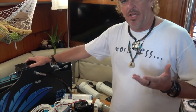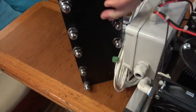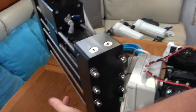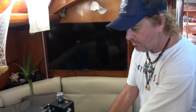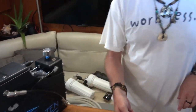The system has two major components. The first is the reverse osmosis or desalination plant — this is where the membranes are. It's all cased in, but behind the casing are the pressure vessels bolted together with manifolds on both ends. All the water is plumbed between the membranes internally, so you don't need a lot of external plumbing, meaning far fewer fittings that could go wrong. There are just two main fittings transferring water from the membrane outlet into the recollection system and back down to the pumps.